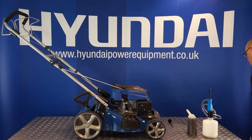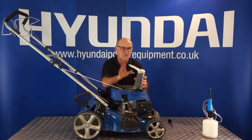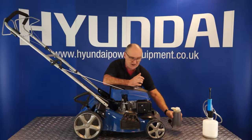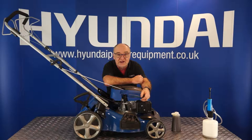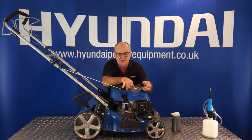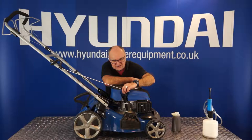Having removed the engine oil, you'll need to refill it. We recommend either a 10W30 or a 15W40 engine oil. This machine takes around 0.6 of a litre. Fill up the engine oil gradually — maybe a couple of hundred millilitres at a time — and then measure it with the dipstick to see where you are. When you pour oil in, allow it time to go down the tube and into the engine, because if you go in too quickly there's a risk you'll just be measuring oil still in the tube and get a false reading. Allow it time to drain down for a true reading.